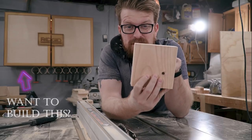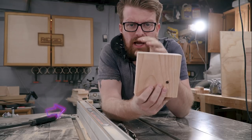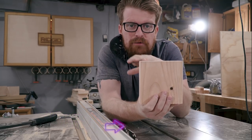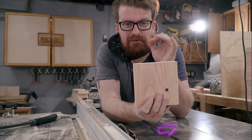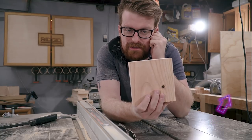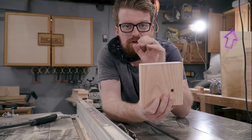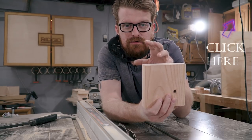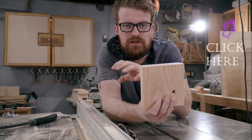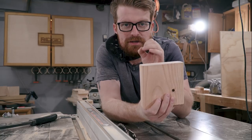After I cut down the boards — at least the nine-and-a-half and the seven-and-a-half-inch long ones — I went ahead and trimmed them to their final width, or depth I guess. I did that so I could figure out exactly how much scrap I would have and what I could salvage out of it. Boy am I glad that I did — I would have had to buy another 2x6 otherwise. I'll tell you exactly how many 2x6s you need to get all the pieces to cover that full two-foot by two-foot project panel.